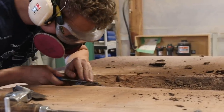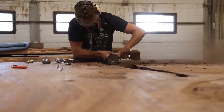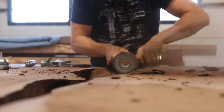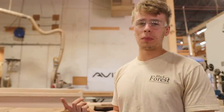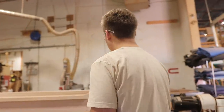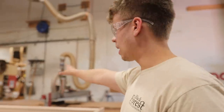Right now Ben's working on the smaller table for Ellis and Don. We're just debarking it right now to get it nice and clean for the resin pour. You always want to get all the bark off to get a really strong bond. We're cleaning that all out - we just use a wire wheel on a drill most of the time because it's easy and it's quick. It seems to work good. And then there's the big one - that's going to be ready for the mold in a couple of hours.